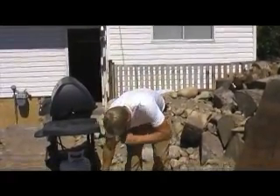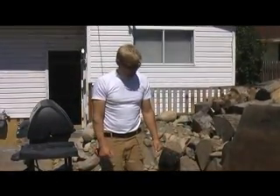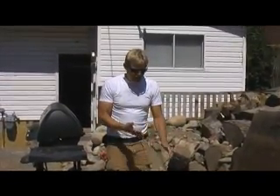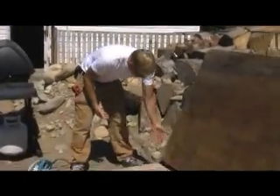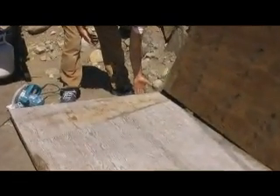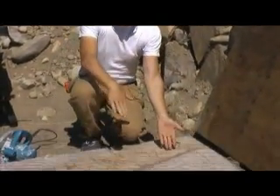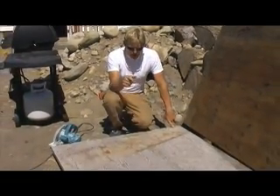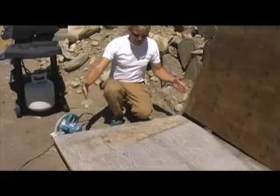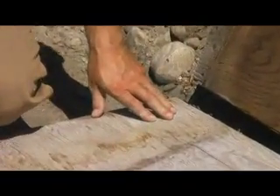The spacing on the plywood itself — I know you can't visualize it too well with it laying on the ground. It's kind of up to you; I like 12 inch centers. In this particular case I'm using 10 inch for a different reason. This is going to represent the bottom of the wall — this will be standing up in place. These two sheets represent one wall section about 8 inches apart. I've screwed in a screw here and on the other corner to hold the two sheets in exact alignment. All we're going to be doing is slicing into the surface of the plywood with the blade.